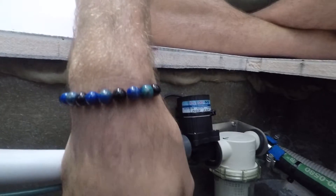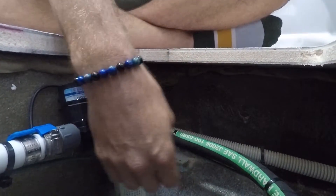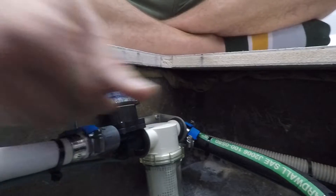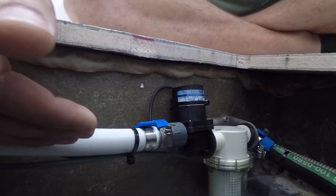If the discharge is lower, I'm leaving the possibility for an air trap — it could be problematic. And if this hose comes up and then comes back down, I have a loop in there, that's another area for an air trap to happen. The discharge of the pump has to be under the water line. We try to have an uphill rise after the hose, so that if there's any air that gets into the system, it always has a place to exit.